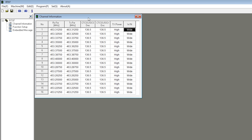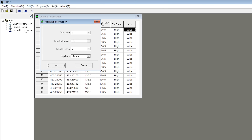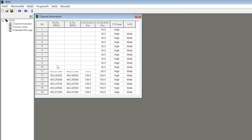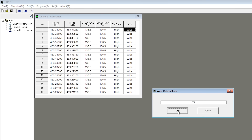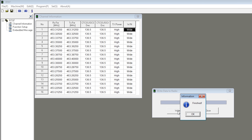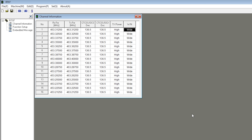One other important setting you may wish to play around with if you're having issues is within the function setup — there is a squelch level. This shouldn't matter too much if you're using CTCSS or DCS, but you can set a squelch level here. Don't forget to click OK to apply those settings. If you want to write this back to the repeater, click on 'Program', select 'Write Data', click the right button, and there you go — it's extremely fast.